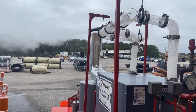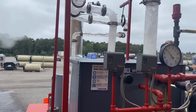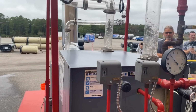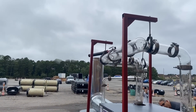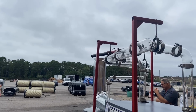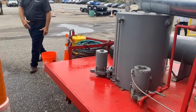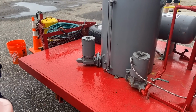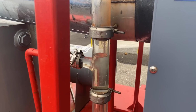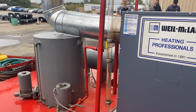Like I said, now the low water cutoff just went out. It starts knocking. The burner's off right now, so hopefully it doesn't knock too badly when it starts feeding. Once it settles down, it's going to probably realize that it's out of water. And now the feed pump's running, feeding water back into the boiler. Again, I shouldn't lose all that water in my system, but I did because I don't have a system. So now my feed pump is kicking on. I'm bringing the water level back in, and sometimes we get some bang. So it's behaving itself today.